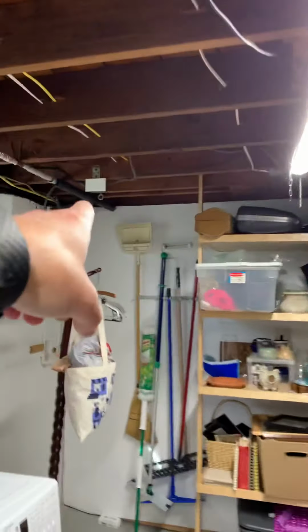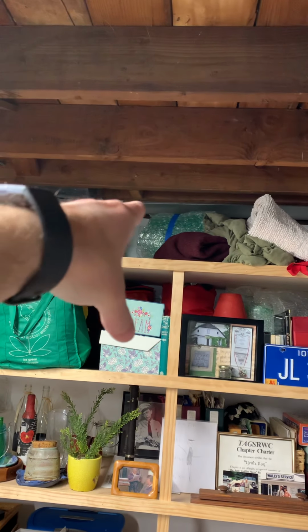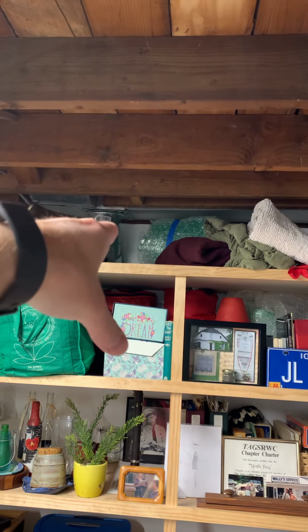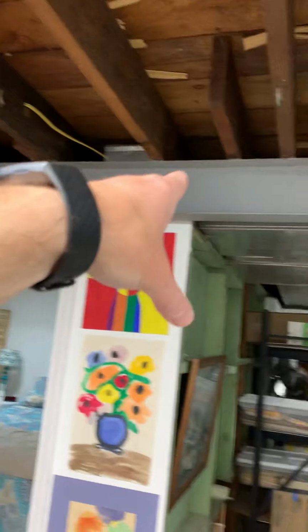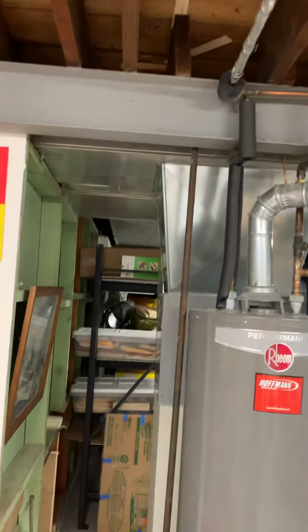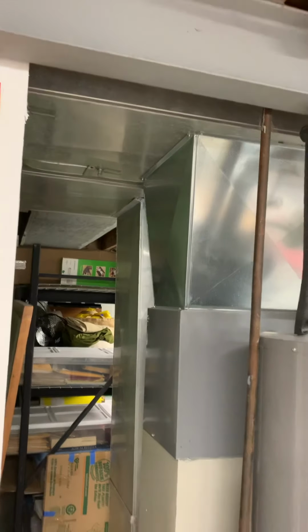And in the ceiling on this wall, they had the pipes freeze over this past winter. There's hardly any heat that comes out of there. So what we're gonna do is cap off that supply because all I did was just tap into one that was already going upstairs. Seal that, and then we're gonna run a new 6-inch duct across the top over to here, tie in, make sure we put a supply damper in there so they can adjust what they need.